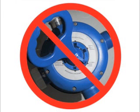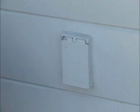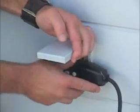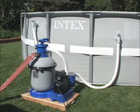The pump must not be on when the valve is in the closed position. Pressure buildup could lead to an explosive rupture. The entire system must be connected by a ground fault circuit interrupter, GFCI. Hoses must be tight and sand loaded correctly.